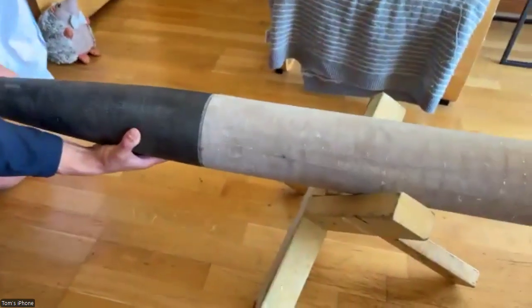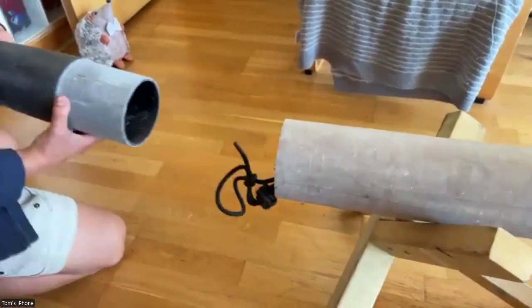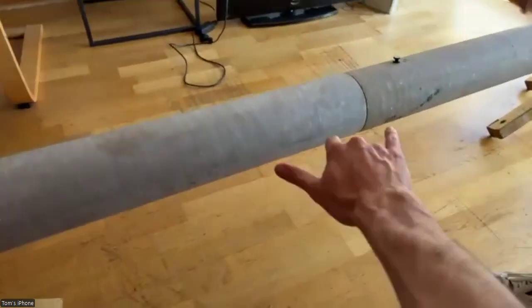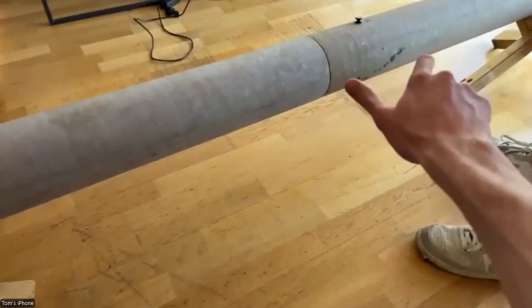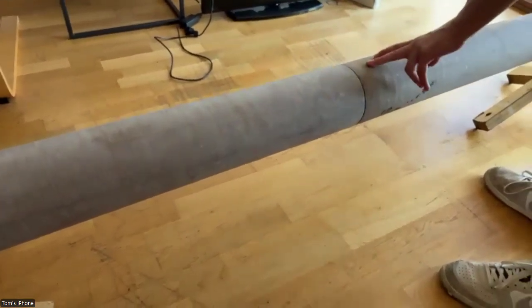So it's 1 cal, so it's 5 inches, the shoulder for the nose cone. There would be a bulkhead on there as well. Yeah, we're gonna put that. And then our coupler down here is 8 inches on this side, and it'll be held by shear pins, and it's 5 inches down here, and it'll be bolted into the payload support structure we've got. It's an aluminium coupler, so we're tapping the holes for that. So the engagement on this side's 1.6 cal, and this one's bolted.